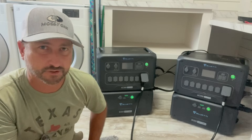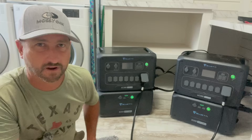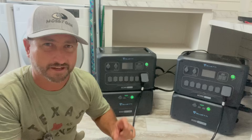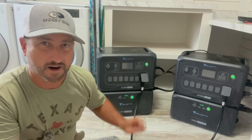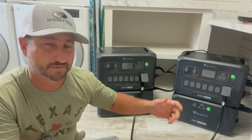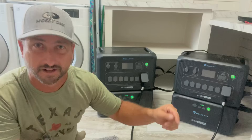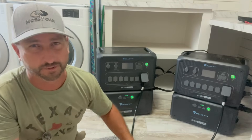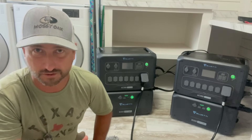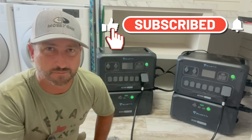I'll have links in the description where you can buy the inverter and battery, and a discount code if I can get one, plus links to the generator plug, the lockout breaker switch, and the lock. This is critical — if somebody were able to turn that breaker on even without the Bluetti powered, that plug would become energized and a kid could get shocked. Please do not operate this without some sort of lockout to prevent someone from accidentally turning that switch on. Please like this video, subscribe to the channel, and we'll see you in the next video.